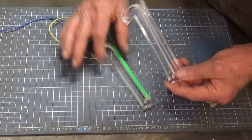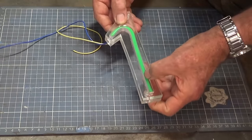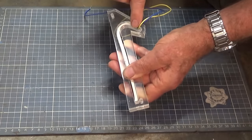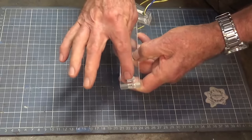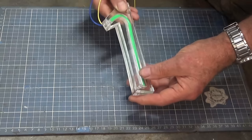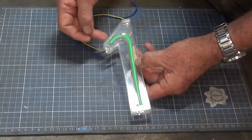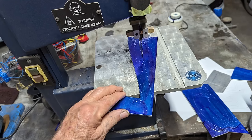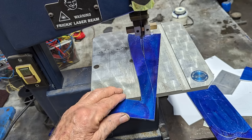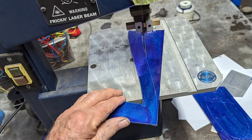You need two of those panels, so the LED strip will poke up inside that profile, leaving about three or four millimetres on both sides. After assembly I'm going to use clear silicone to seal up both ends. I haven't decided yet whether to pack silicone the entire length of the LED track - that would be the most durable approach but also very messy. I'll bond the aluminium top cover to that with silicone as well, to keep moisture out between the different layers. To make the aluminium profiles I traced the acrylic shapes onto 3mm thick aluminium and cut the profile on my small metal cutting bandsaw, then refined the shape using files and the belt grinder.